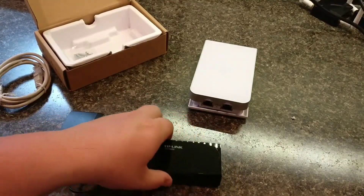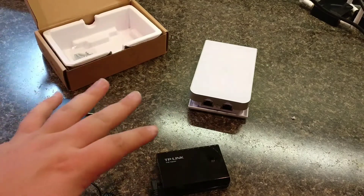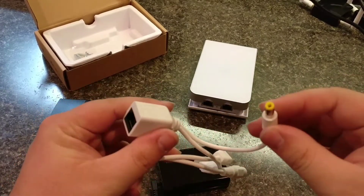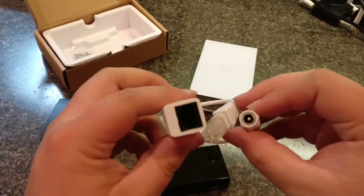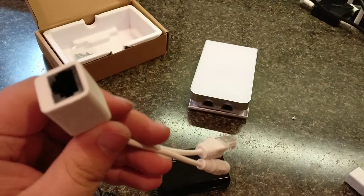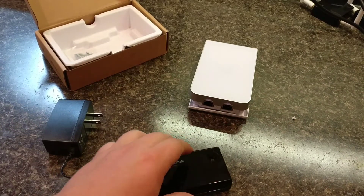This unit isn't really the focus of the video, but I did want to make it very clear that you have to have a PoE injector that supports 802.3af. My initial thoughts were that I could use passive PoE injectors — basically you can get them from China for like four bucks. You put power in at one end and it spits out PoE at the other end. That's what I was assuming I could use, but I was wrong. It has to be 802.3af.